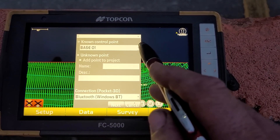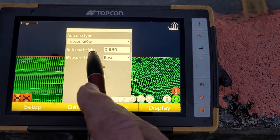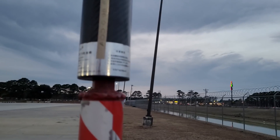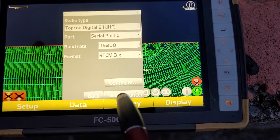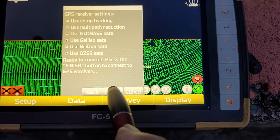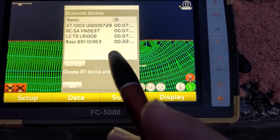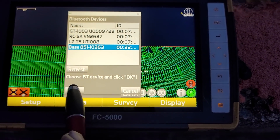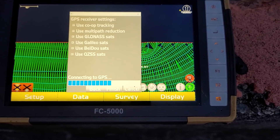GPS base station over a known point — Base 01 — that is correct. Hit Next. You have GR5. The antenna height is 0.980 because I have a battery stick underneath it and it's 0.98 feet tall, so you plug that in and that keeps your batteries up so you don't have to carry a car battery. You say Next, your radios are already set, so you say Next. There are all your satellites. It finishes and then asks you which one you want to hook to. This particular one is Base 851-1063, so you click on that and say OK.